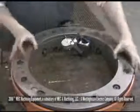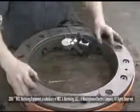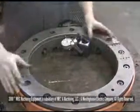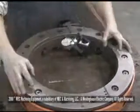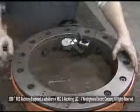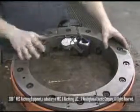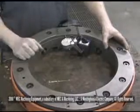From there, go to the sides, these two directly across, touch those up. And then you'll touch these two up here, and you'll come back and fill these in directly across from each other. Here, there. If the machine gets too tight on you, you may have to go back, find out which bearing is too tight, maybe break it loose, and do a final adjustment on it.